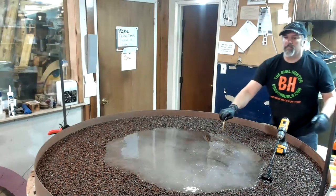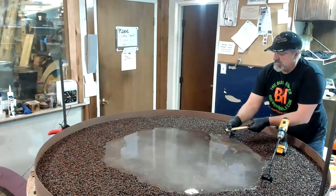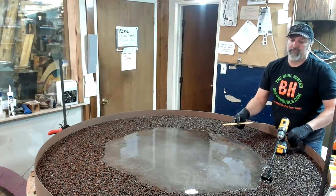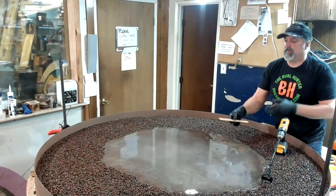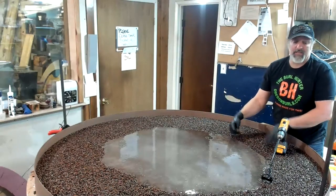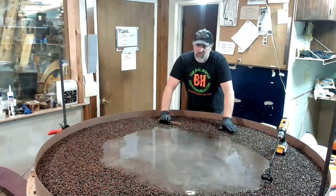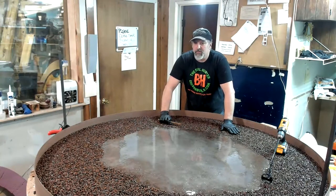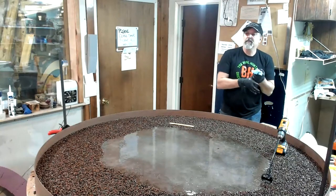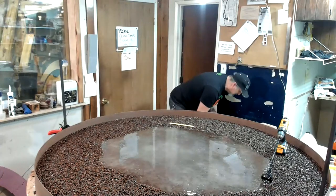One thing about using foam core, it has lots of flotation to it. So even though it's stuck to the side and possibly the bottom, we're going to take a precautionary measure and put a board right there in the center that has Tyvek tape on it, and then clamp it down. The last thing we want is this thing to start bowing, because that's what happened with the other one. No fun, no bueno, no good, no happiness. We wasted probably about 3 gallons of epoxy, maybe 4 gallons getting it flat again, and we have to do the process over.